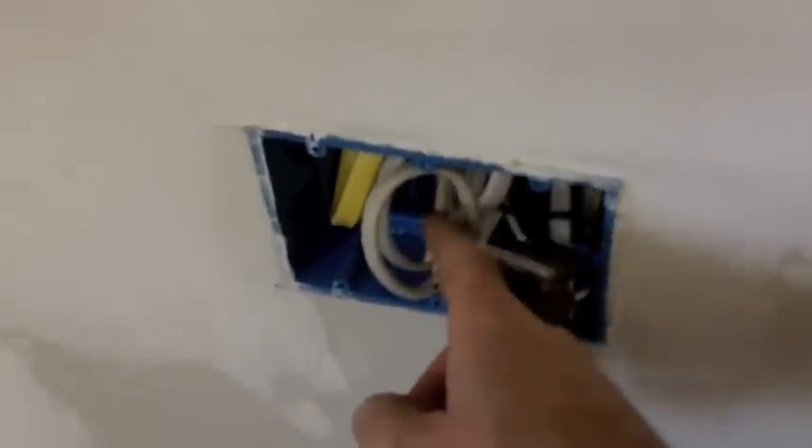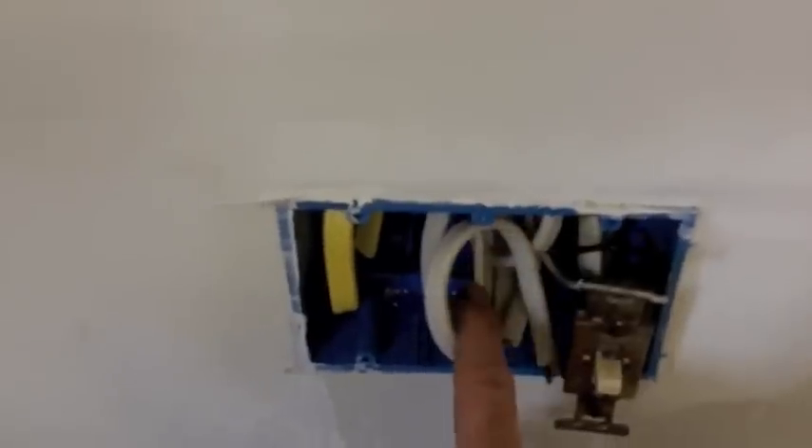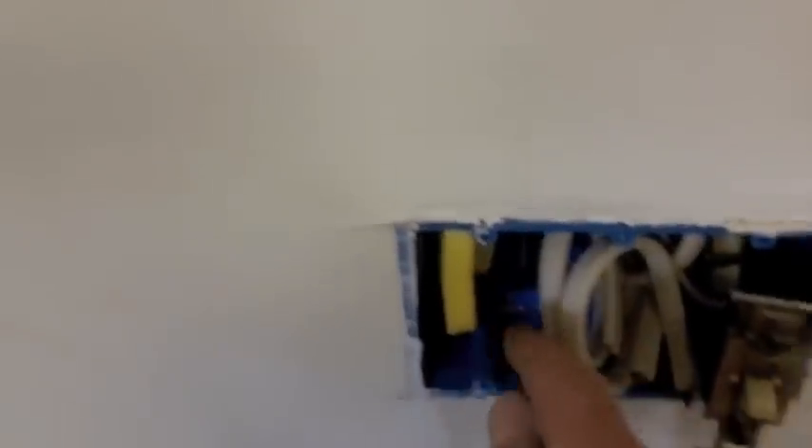On the back side of this wall there were two wires stubbed out and wire-nutted in. Before the inspector came this morning I put them in a box — got an old-work plastic box, removed the light fixture from the bathroom side, cut a hole, and put all those connections in properly. Also, I had talked with a fellow YouTuber about the power I was using, and whether an appliance circuit could power lighting. I changed it before the inspector got here — I dropped another power lead utilizing the 15-amp circuit that the light is on to run the lighting independent of the appliance circuit.